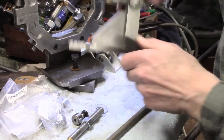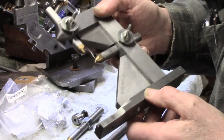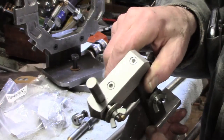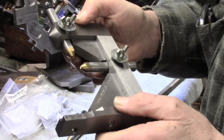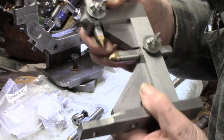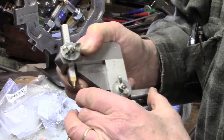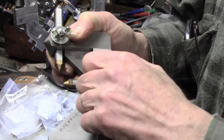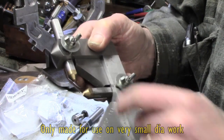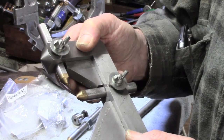Just out of interest, here's the old traveling steady. It's made out of solid stock — not much machining really, bolted together with fairly substantial gussets — made in 1988. The fingers are fairly short but the locking system is similar: double pins that bear against the flat, so they're fairly easy to set up. It may not be worth the trouble to modify those, although I could put a thread on them except there's no room for a nut. So I think these will stay the same, except possibly putting cam rollers on the end.